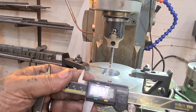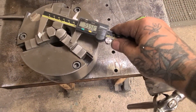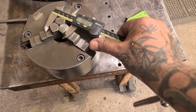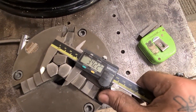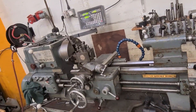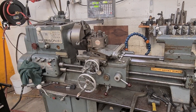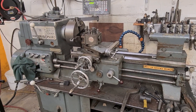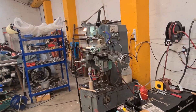I'm going to see now if that size will fit in my three-jaw chuck. Oh yeah, easily fits in there — we can go right down to smaller than that, to 35 maybe. So I'll get it mounted back on the lathe. I want to see if it'll fit in the four-jaw as well. Either way, we can now finish with the milling machine for a bit and get it over into the lathe.